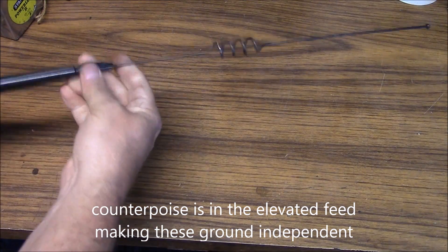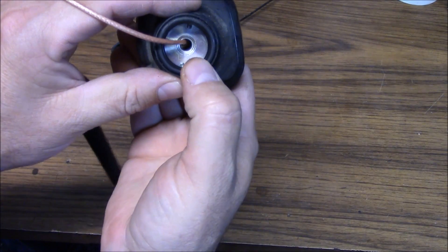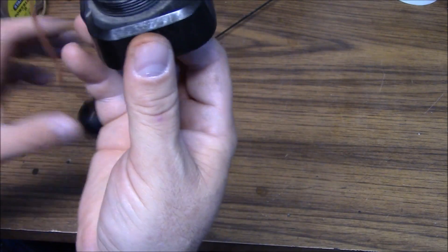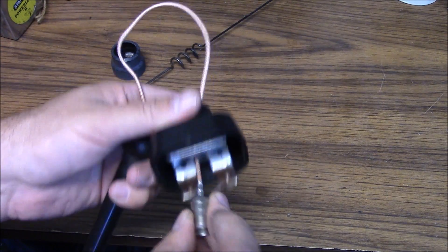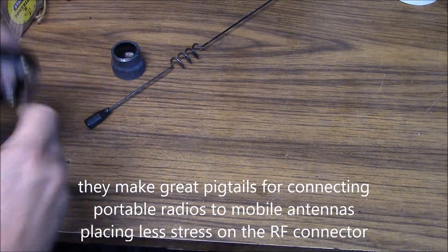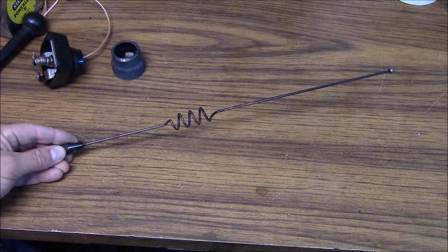What I always do is just use the resonator off of this by spinning it off. In the body of it, when you break it loose, you can see your clamp mount and how it stops right there with just an O-ring base on it. What I prefer to do is cut this RG-174 size jumper off right here, repurpose that as an adapter, put an SMA connector on it, and then merely use the resonator. As you'll see, this resonator is slightly longer than the other one.